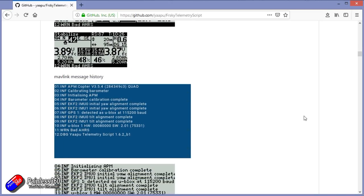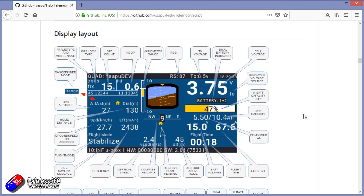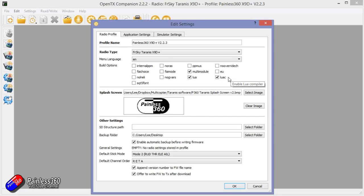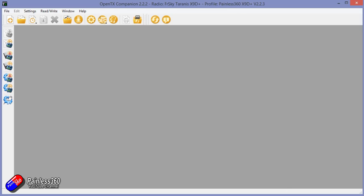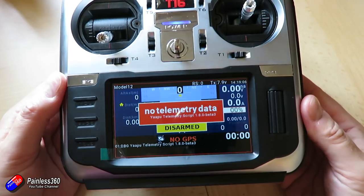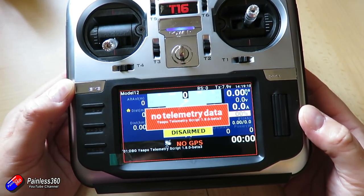So in this video, let me show you how I've got it working. Caveat: this is technology that isn't actually released yet, but this is to help Andrew and those of you playing with this kind of get to the end and have it all working. First thing we need to think about is the radio. The radio itself and the version of OpenTX on the radio has to be flashed and support both Lua and LuaC scripts. If both of those are supported, you'll be able to run the scripts and have it work. Luckily, on radios like the T16, it has been flashed with JumperTX with that enabled. If you upload the script and it doesn't work, there's every chance it hasn't got the LuaC script option selected — I'd recommend you update to version 2.2.3, which is what I'm using here for the demo. I had to bite the bullet to get this working.